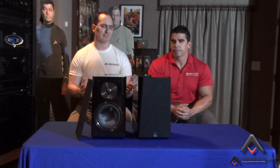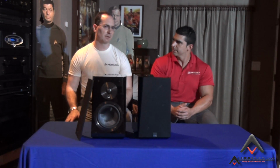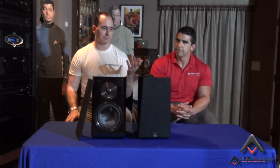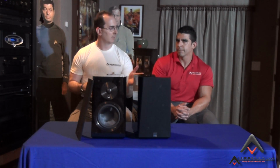I'll give you a couple of things that I found that don't quite conform to the spec. Not a big deal, but for example, they claim the speakers are 8 ohms. I measured them, they're really 4 ohms. Even at the IEC limit, in an 8 ohm speaker, it has to be 6.4 ohms. These things dip down well below that in the 50 hertz range and the 200 hertz range. But they are very high sensitivity. And in fact, these guys are one of the few speaker companies I could literally count on one hand that give you a sensitivity rating, not at full bandwidth like most do, because that inflates the number. They give you a sensitivity rating from 300 hertz to 3 kilohertz, which is a standard on how you should be doing it. It's how we do it when we measure speakers.